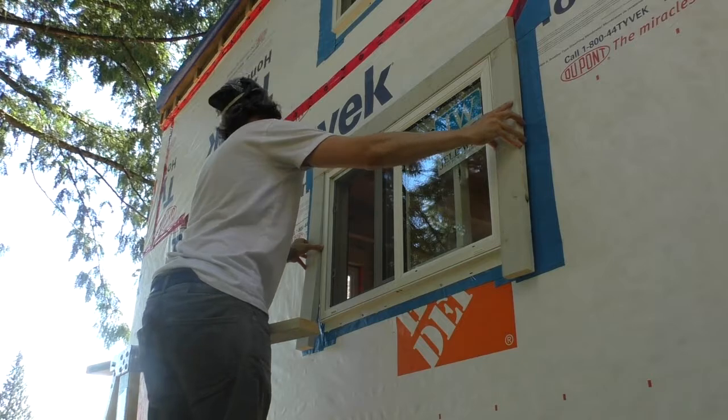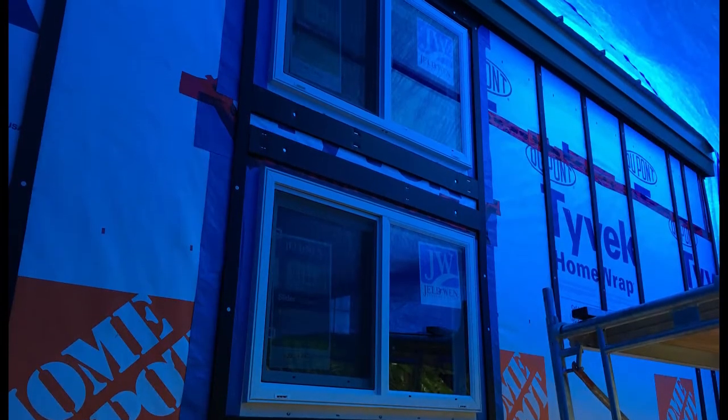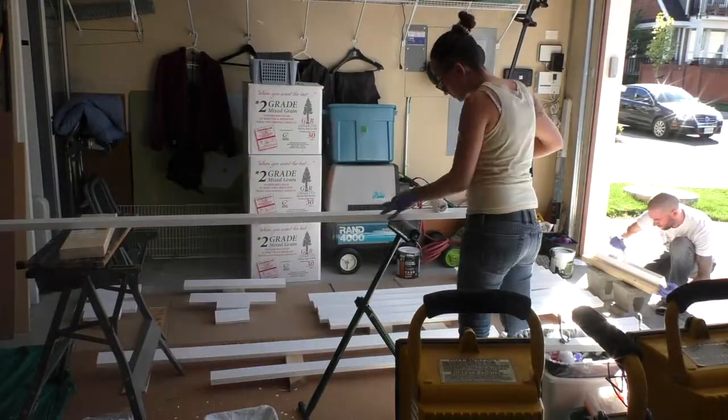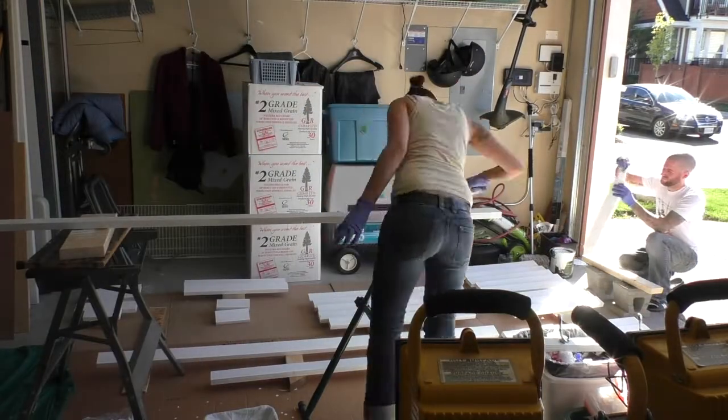I made up my mind after reading more about the rain screen, and it does make sense that it would go over it, just like the siding. What I didn't know was that metal flashing is commonly used around windows and doors. I'm not sure how I missed that, but I'm pretty sure I'm still safe because I've allowed airflow and drainage in all the right places. Either way, here's how I made the trim.